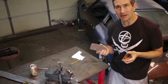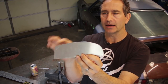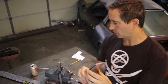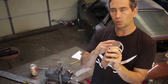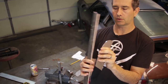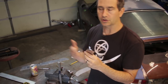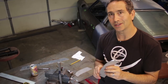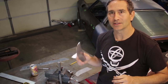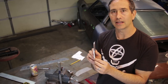I'm about to take these parts from last week. These are the CNC profiles of the bumperettes. There's an inside and outside profile, and what I need to do is rather than just weld this piece on top like so, I want to create a curved edge. So if I was to weld this square, I wouldn't be able to get a very large radius on the corner. So what I'm about to do is take these precision machined parts and stick them in this thing I made on my vise to actually bend them by hand to create that profile along this edge.